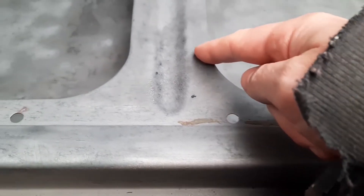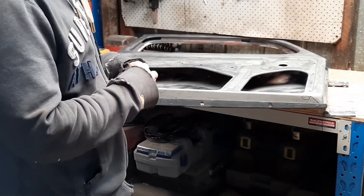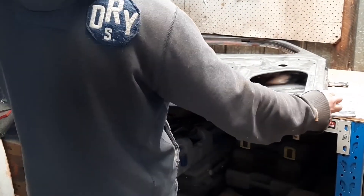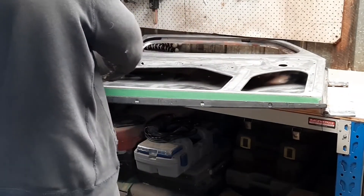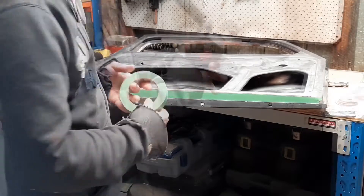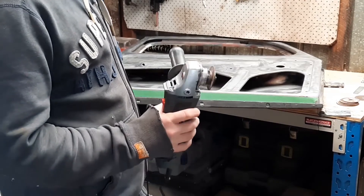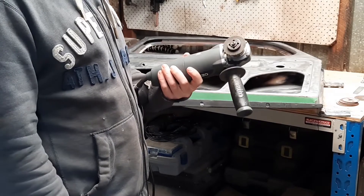First, let's mark it up and cut out the old material. A bit of masking tape always works well for giving a straight edge to cut along with the grinder. I'm normally pretty good but there are times when for some reason my aim is really off. Now grind time — I also love it when you have to grind close to an edge because it means you get to use up all those grinding discs that for thick materials you can't get to.